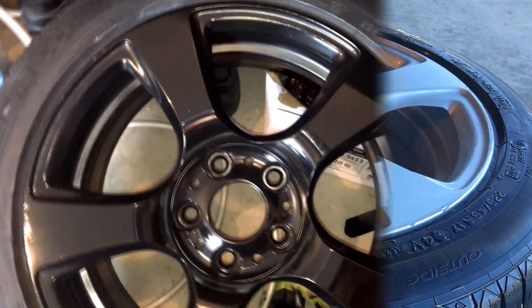That smooth surface is what the final layer will accomplish — put it on thicker so all the beads get smooshed together. Now here's the final layer: I'm putting it on pretty thick, just not thick enough to drip. Notice I'm not keeping my hand in a single spot because that creates a big pool that's really ugly and hard to fix. Move in straight or circular lines and don't hold it in one spot. Don't get too close to the surface either.